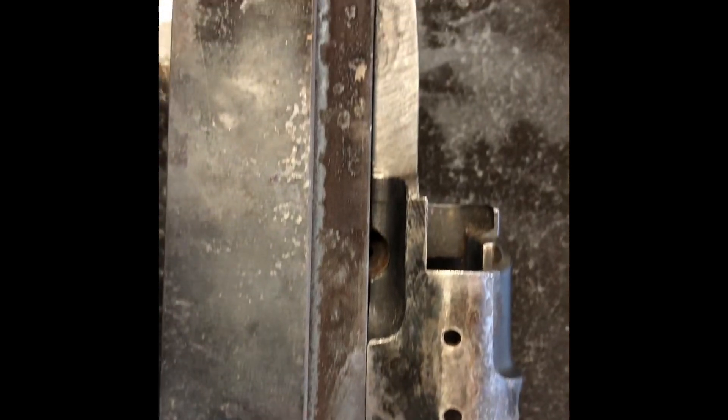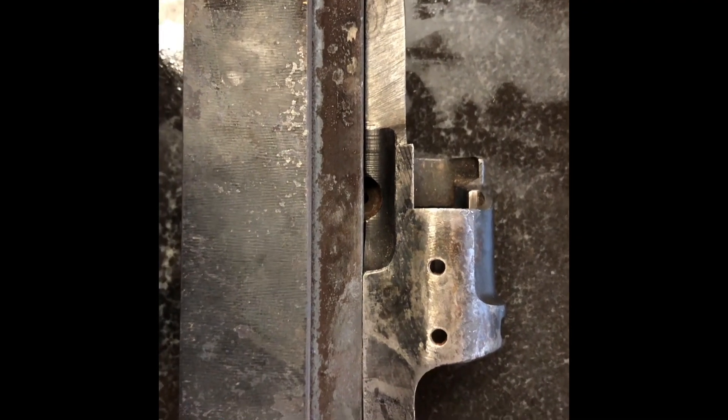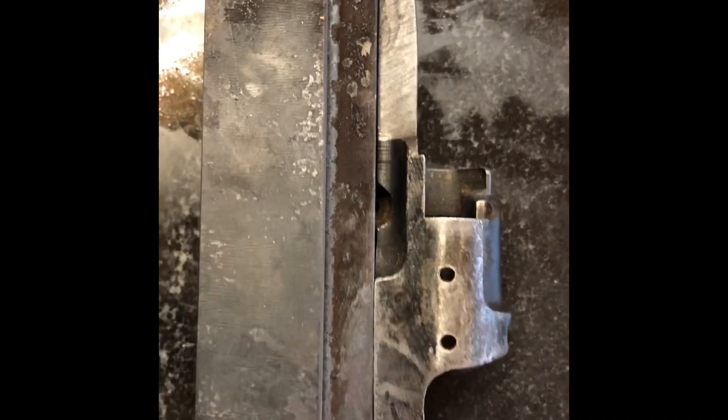As you can see, this action is obviously bent. I'm going to snug it up and show you how to apply a little extra pressure. I'm going to be careful doing that because a lot of these actions will crack further if you apply too much pressure, so you just want to gently apply pressure. The idea is that when you go to anneal this action, you want some tension to draw it back down and straighten itself out under heat. Sometimes they'll settle right down and you don't need anything — steel does want to return to its state of least stress.